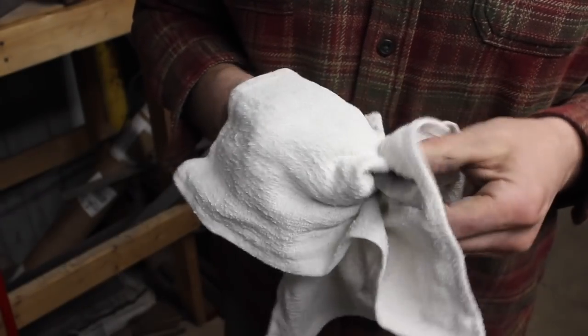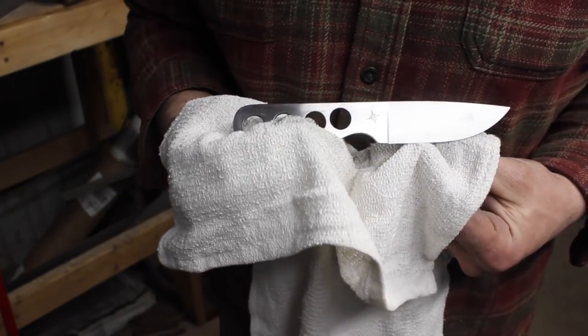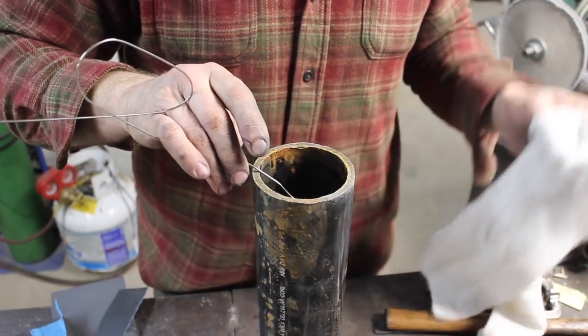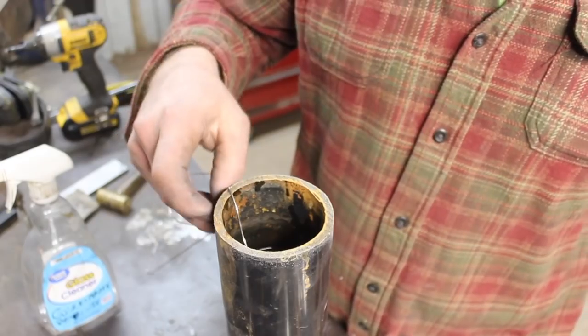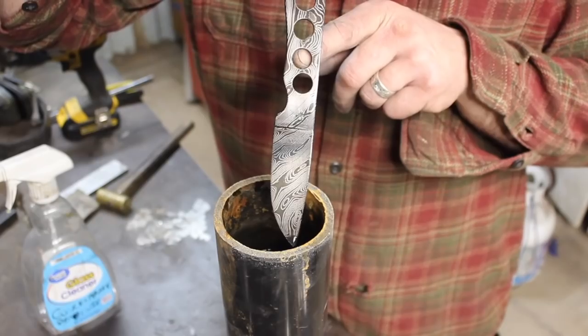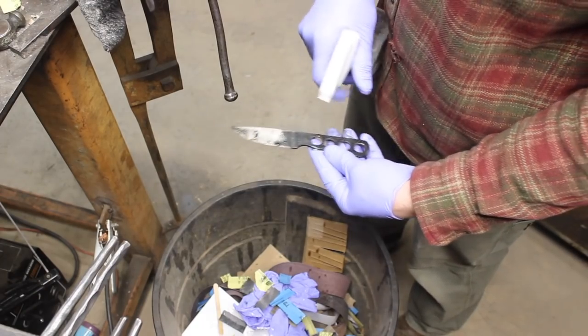And there it is. I forgot to stamp my logo in there, so I went ahead and etched it with the electronic etch. So into the ferric chloride we go. And I had it in and out 3 times. I wanted a nice deep etch on this, so that through use, you're not going to have to worry about ever losing the pattern. It'll be there.